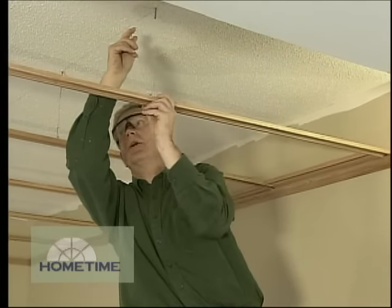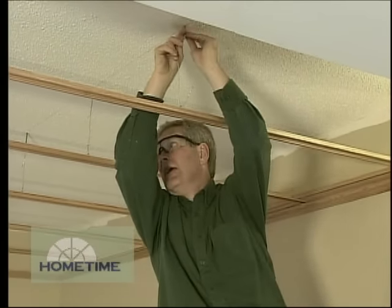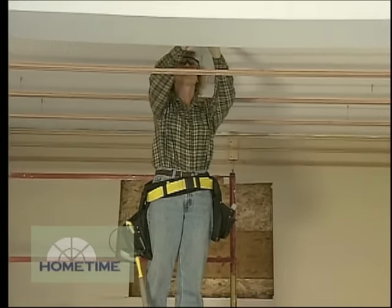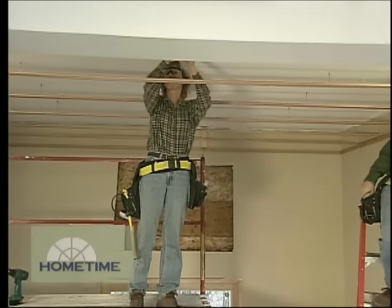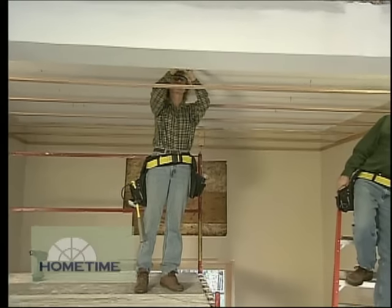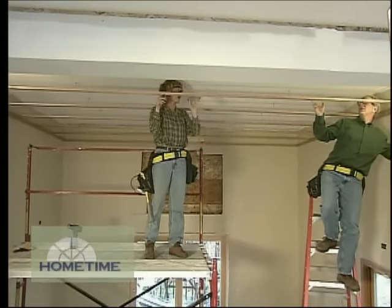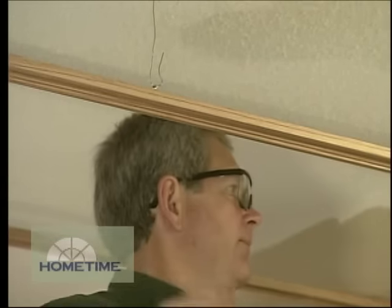These blue lines are the bottom of our trusses, and we aren't installing a bolt in every truss, just every other one as it runs across our spacers. So we'll end up with three of these little eyelets in our runners, and then each side of the runners is supported by our panel molding — supported in five spots, which should be just fine. Now the trickiest part is getting the runners perfectly straight and level. We considered using our fancy rotating laser level, but with two people it works pretty well just to eyeball it and check it with a string every once in a while.